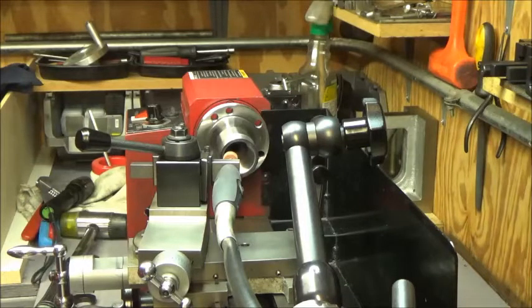I had a couple of stones, one of which looked like it would work fine, which I had dressed up yesterday. So anyway, I'm going to put a short video together, and I'll get another shot of this from another angle. I've taken off maybe 1,000th so far, and it cleaned up right away with just a few tenths. I'm taking off 2/10 a pass, and I'm shining a light down the bore to see where the end is. It's going along just as smooth as glass.